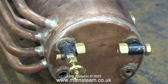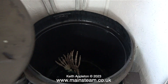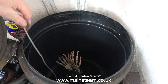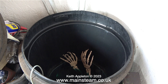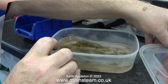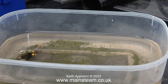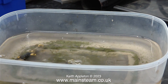No sooner had I fitted the water gauge I unfitted it, then I tied some silicone rubber tubing around the tubes underneath the boiler. Then I went into the outer part of my workshop, removed the lid from the acid bath, and carefully deposited the boiler in the acid, making sure that it didn't float - that's why I'm bouncing it around. I wanted to make sure there were no air bubbles left inside the boiler, because air bubbles wouldn't descale it. I'm going to leave that for 24 hours, and also during that time I deposited the water gauge in a food container full of cellulose thinners. I'll remove the boiler from the acid bath tomorrow and see whether the paint has fallen off the water gauge fittings.